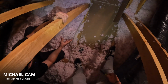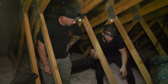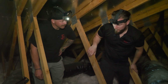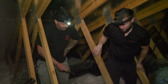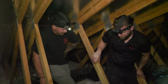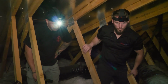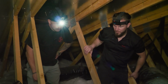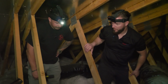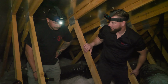We've got where the fan goes. Looks like we have some power options. Jumping through the attic, you can look for circuits. Try to stay away from bathroom circuits. Kitchen circuits, those are a little bit more finicky. But looking for bedroom circuits to tie into, you're chasing wires, trying to find out what's power wires running through, jumping from box to box. So general rule of thumb is look at the FAU, see if that's a viable option. Look at smoke detectors, see if that's a viable option. Outside of that, stay away from the kitchen and bathrooms and whatever else would work next.